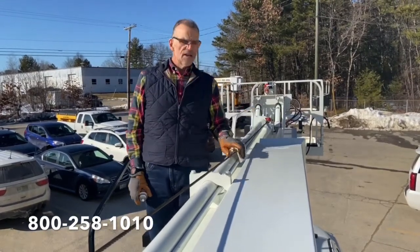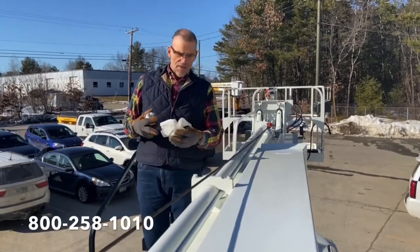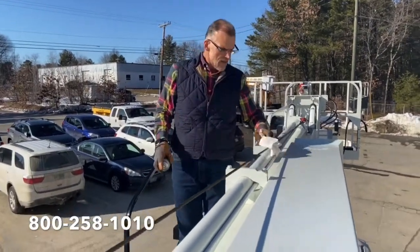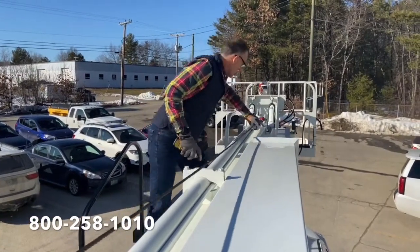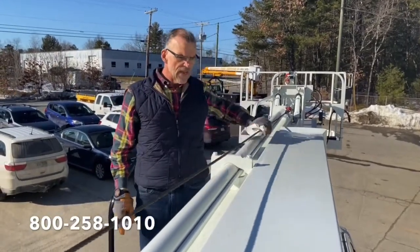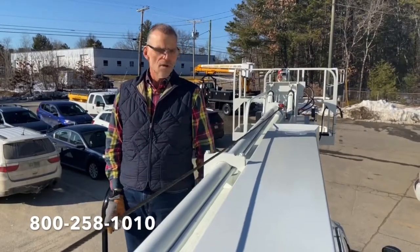The core is lubricated; now you have to lubricate the outside. The best way to do that without messing up your entire machine is to spray some lubricant onto a rag, and then run the rag up and down the cable. What that's going to do is evenly coat your cable and prevent it from getting damaged from rain, moisture, and so on.